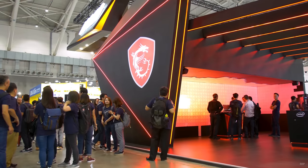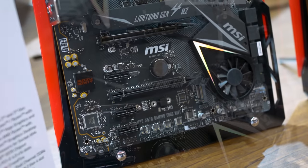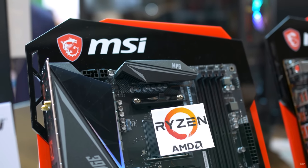Before getting to those more recent developments, let's take a step back and talk about the MSI motherboards in question. Hot off the release of their highly successful B450 range, namely the Tomahawk and Pro Carbon, many were anticipating the arrival of MSI's X570 lineup, us included. However, after checking out the X570 Gaming Edge Wi-Fi, the X570 Gaming Plus, and the X570 A Pro at Computex last year, we were pretty underwhelmed with the VRM configuration, especially when compared to what we saw from Gigabyte and Asus.